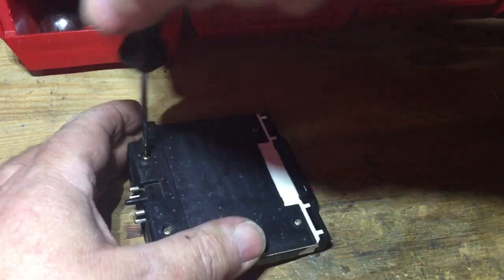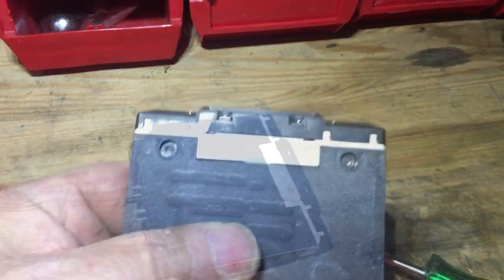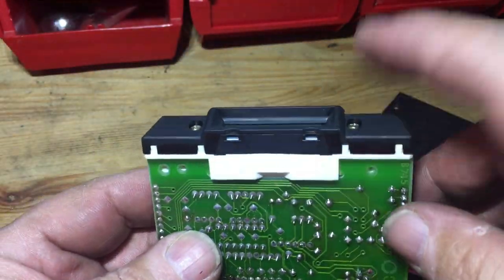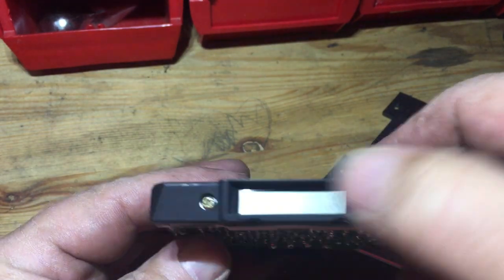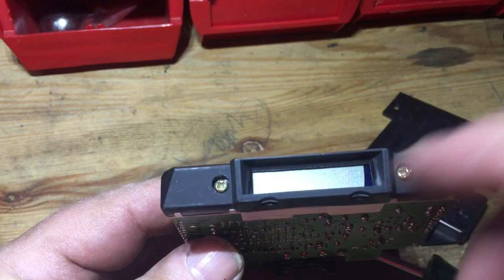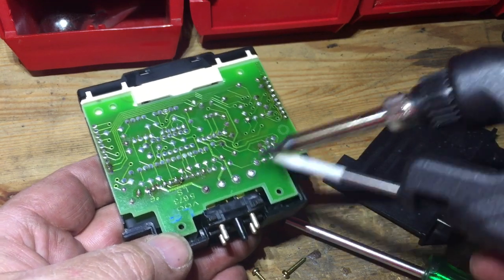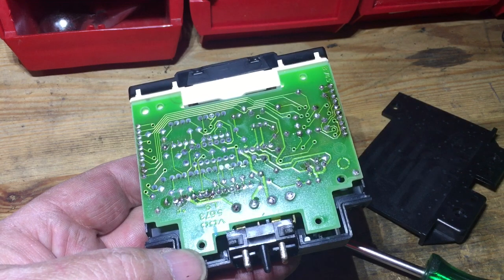Take the little screws out, all of them, take this off, and here you have all the soldering joints. One thing you don't have to do: don't take these off, because I now know how the LCD screen got damaged on the other one — if you loosen these you might de-laminate the LCD screen. These are all spare parts, but I'll at least show you how to resolder the joints. This is going to take a while — take your time and one by one go heat them up and put some fresh solder on all of them.